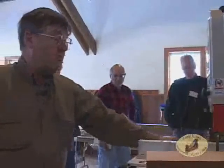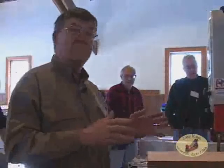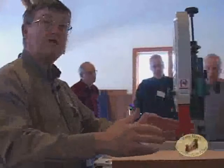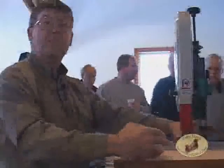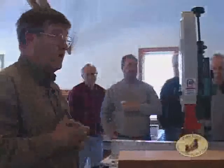There are a couple of reasons why accidents happen. One is that people just lose track and get busy and don't think. Another is that if you're doing any kind of scroll work — cutting bowl blanks and so on — it's very easy to forget where your thumb is and come around into the blade, especially if you have an uneven edge like a piece of green wood. So you really want to think carefully in that situation.